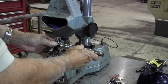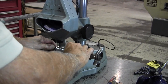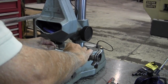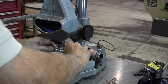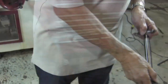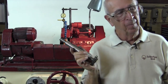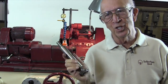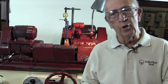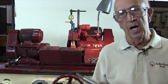That's on zero. It's within a tenth and a half to two tenths of being dead straight. Is it perfect? No, but I didn't have to make five passes trying to get the taper out. I can just tweak it a little bit now and it's done. I bet I haven't done this in 40 years, but I still remember how to do it. That's the trick to getting the taper out without having to take a cut on your part.